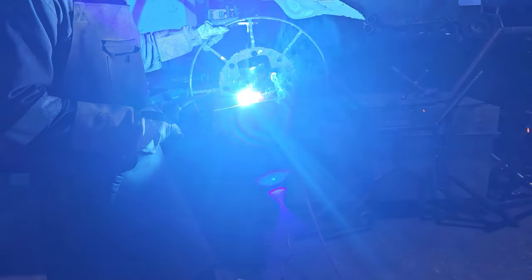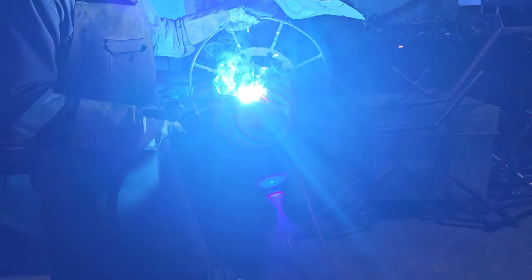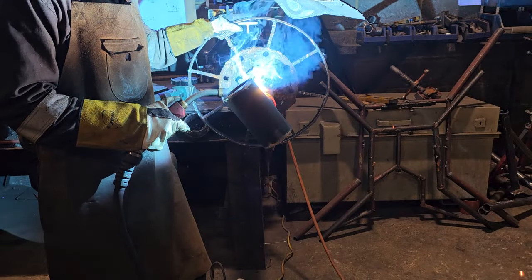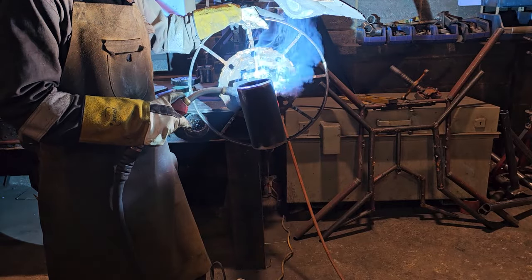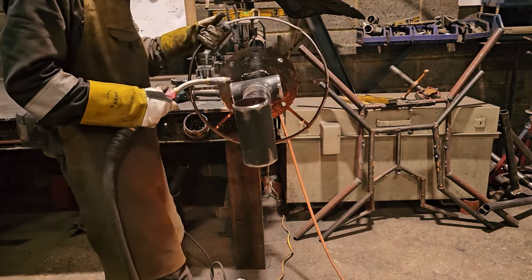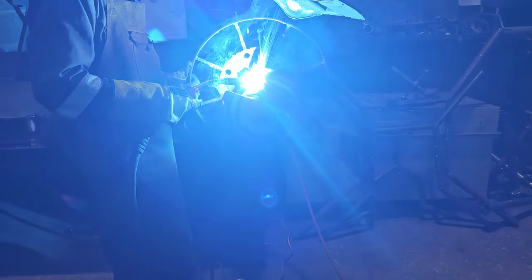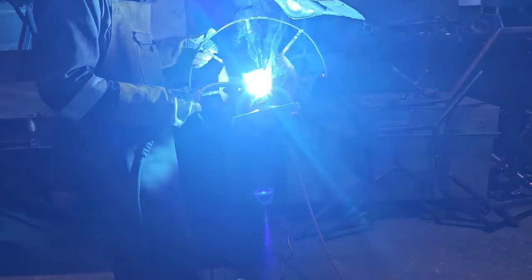Take this 3-inch cap - it's welded at 177 amps and I weld the cap in one minute. The root won't have taken more than a minute either. So you can bang through tens of butt welds a day very easily. When I've got a bunch of jobs, I'm doing two of these in the morning. There are times when I could be doing 8 of them in a day, 12 if need be - though 12 is a rush. But 8, more than likely, I could just bang them out. It's a ton of welding.